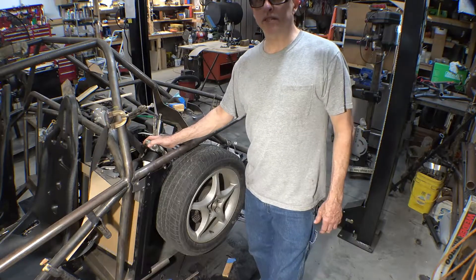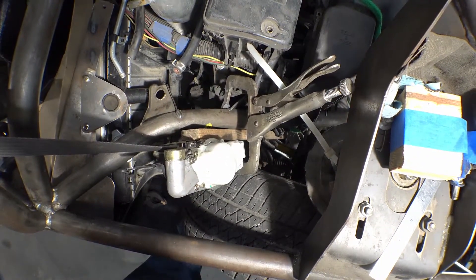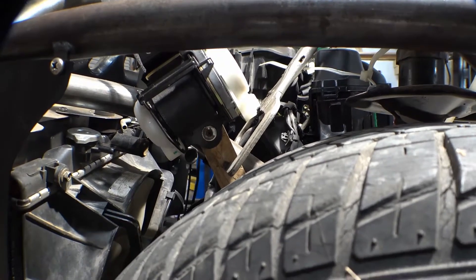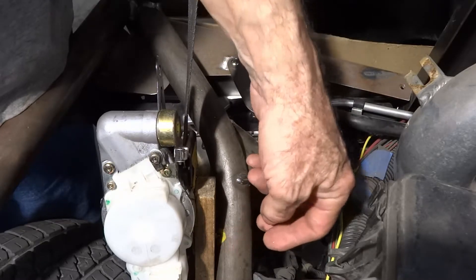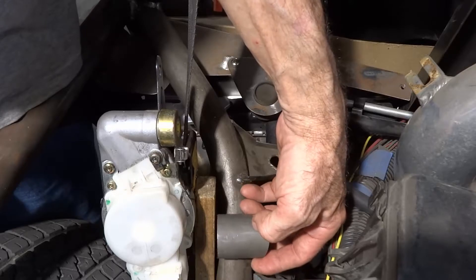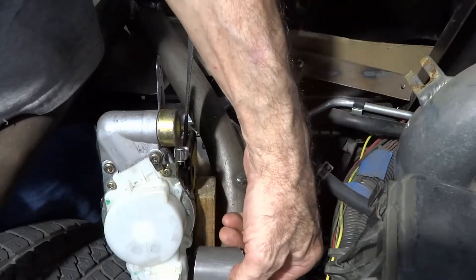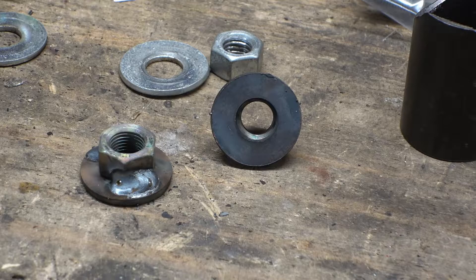This bracket right here is going to have to be a little more substantial than just a piece of wood held in with a pair of vise grips. The center line of our bolt hole is going to be kind of on the upper edge of this tube, so we'll notch a short piece of tube, offset it, and set that there. In the end we'll weld a washer with a nut on the inside so that captive nut can be used to screw a bolt into, to hold that end of it. That should be more than solid enough to hold the seat belt in place.